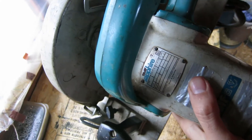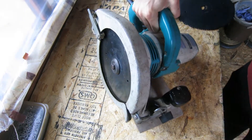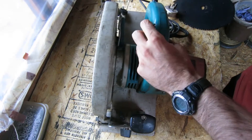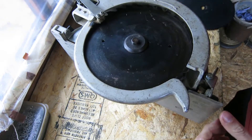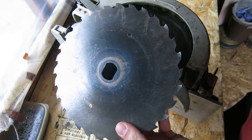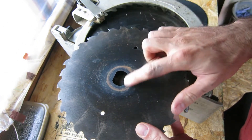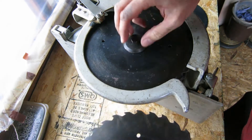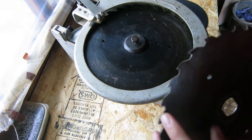See the labelling there — it's a Sapphire 9 inch power saw and it's not small, so it's a struggle for me to hold out and actually have any control over with one hand. So it's a large saw by today's standards, and the problem with it is the saw blades I've got with it are a little bit old and have this slightly weird fitting, so it's not a standard hold. It's a 1⅛ inch diameter and it has a compression fit, which means I've not been able to source new blades for this of the correct size.